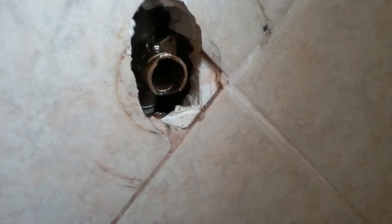This one was really packed. After this, I closed the shower curtains, went outside, and turned the water back on for about a second or so — let it blow all that crud out before I put the new cartridge in. If you don't do that, you're going to stop your new cartridge up again and you'll be doing this all over. I also take a rag and clean as far back in there as I can. You'll see all the crud — basically that rubber is just breaking down and it came out in several pieces. Another reason I had to blow it out and clean the lines.